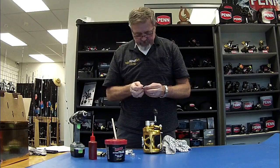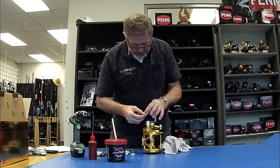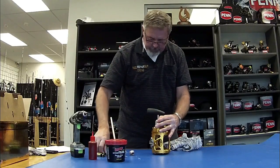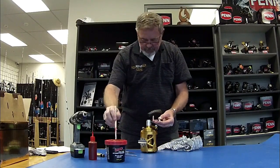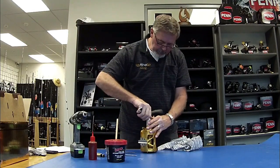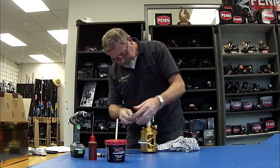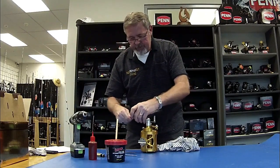And what we have here is our shift button. Also handle locking plate. This must be located in the correct position. Retaining screws. Move it into here. The spanner provided. Just nip it up, not too tight.